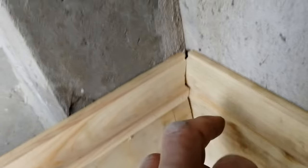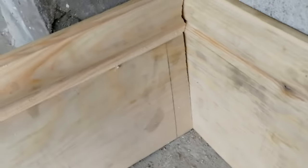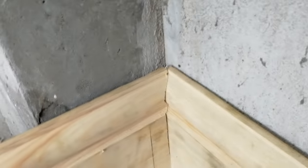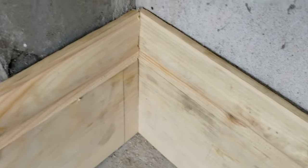Putting the two pieces against the wall — as you can see. Now, as I explained before, this wall is slightly leaning back, it's kicking at the bottom. As you can see, there's a little bit of a gap there. By the time you've caulked it and painted, you probably won't even see it. So what I'm going to do is I'll just pull it out a little bit at the top — made a lot of difference there. Just pull it out a bit, put a bit of wedge at the back, a bit of paint caulk, and there you go. That's about it really. Bit of practice — slap it down to a fine art.